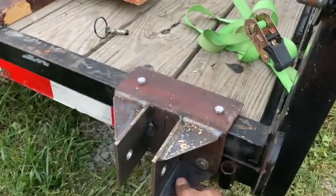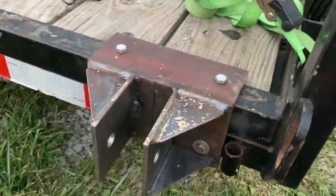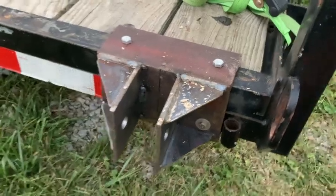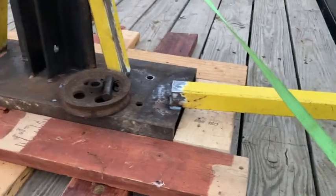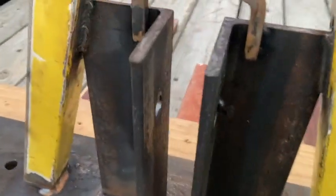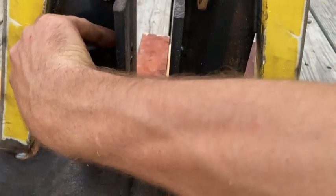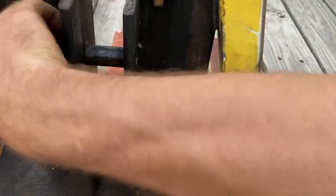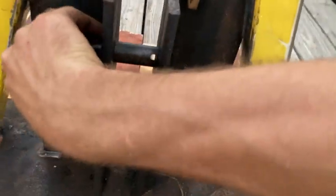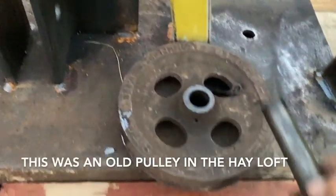The hinge pieces. This angle iron, it's two pieces of angle iron stacked on top of each other. And then here's the redirecting pulley that allows the hoist to pull in a straight line only. There's the pin. This pin goes through the angle iron, and then I welded, you might not be able to see it, but it goes through that, there's a little keeper there, and it prevents the pin from spinning, so just the pulley is spinning on that shaft, since they're made for one another.